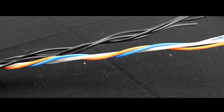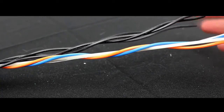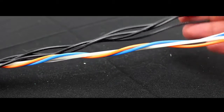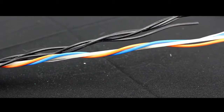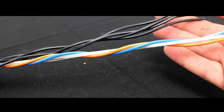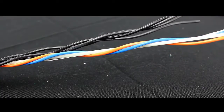If I remember correctly, this cable construction can go up to 72 strands — so 12, 24, 36, 48, 60, 72 — you only have a certain number of buffer tubes. The Altos direct burial construction cable can go up to 288 strands, so there is a larger cable diameter-wise with more tubes in it.